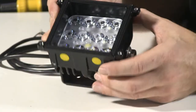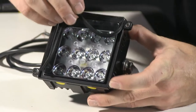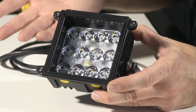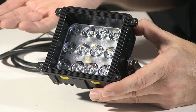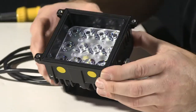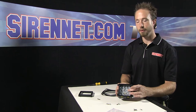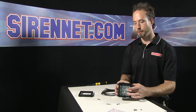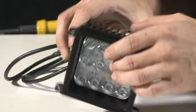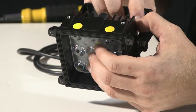So the purpose of those, because you actually have an inset rubber cap here, is when the cover is cinched on, in washing your vehicle, driving it daily through the rain or the snow, or when you pressure wash, if condensation does get in here, the Gore-Tex breathers in the base will allow the condensation to drip through, basically evaporate out. So with that, it's also important when you mount your Micro Pioneers to mount them in a way so that your Gore-Tex breathers are down facing versus facing to the side or facing upward where you wouldn't have proper internal airflow.